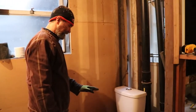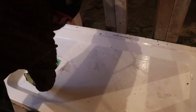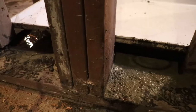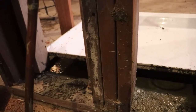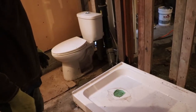The shower here is set. Like you guys can see, the concrete that I put from the other side has bled down here. I just gonna show you guys — you can feel the sound. Look at this — it's solid, full of concrete, very much anywhere you push. This one here, we're just gonna let it sit about minimum 24 hours before we try to touch it. This is just general use cement — it doesn't dry that fast, but 24 hours is plenty of time. We have a lot of things to do, so it'll probably stay a few days without being touched. Later on we're just gonna build a little wall in here and put the shower faucet and keep going.